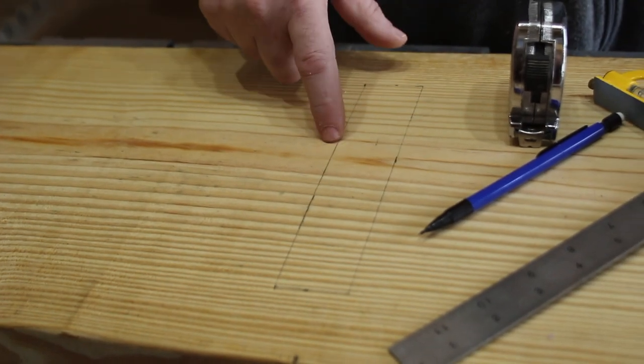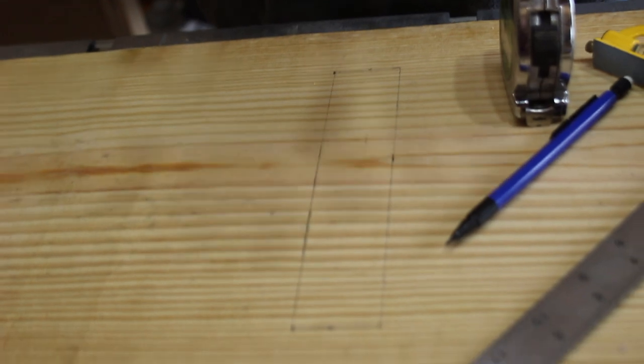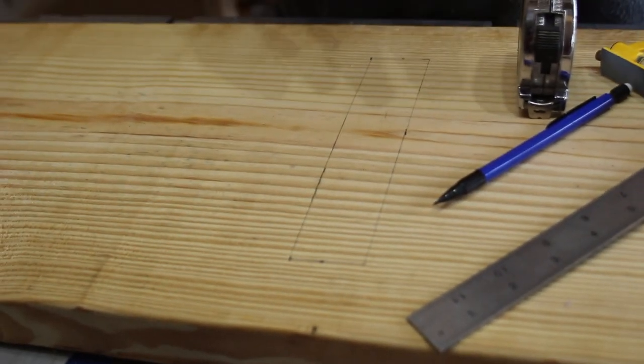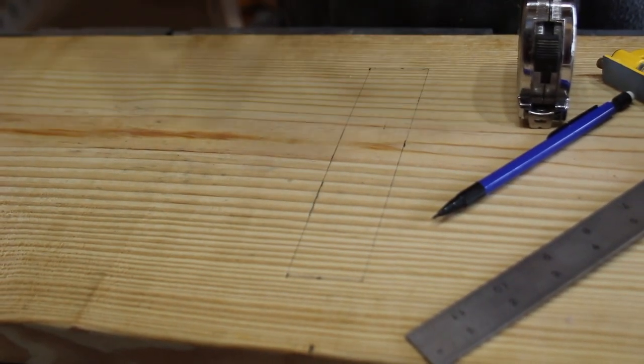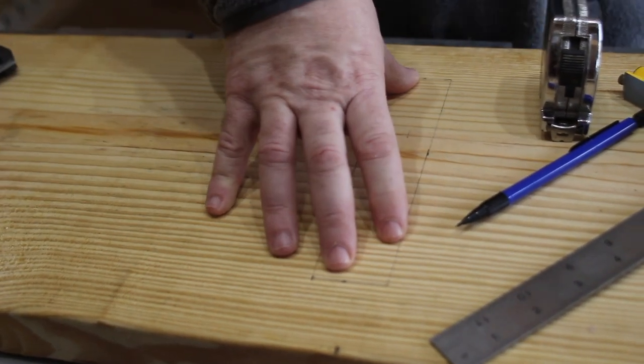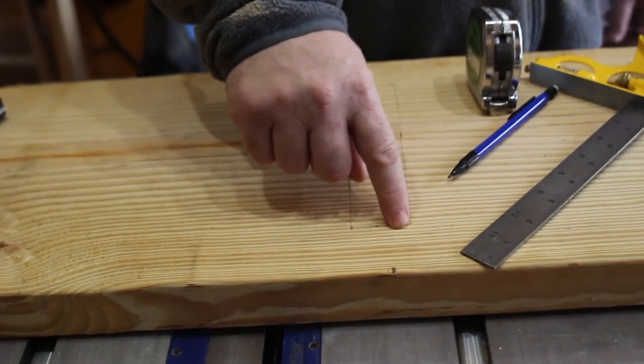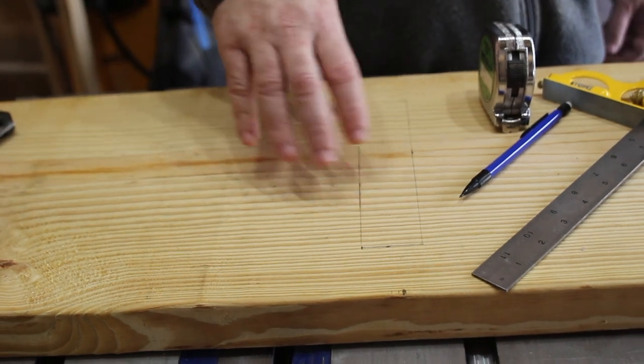If this is too open, too wide, in either dimension, you're going to get a floppiness to the chair. If it is too tight, you won't be able to put it in, which can be a problem. Yeah. That's a big problem. So there are many ways to do that, and you can use a plunge router to take this off. You need to go all the way through the whole wood. Or, because most people have a jigsaw but don't necessarily have a plunge router, we're going to use our jigsaw to do this. So stick around and we're going to have fun cutting with our jigsaw.